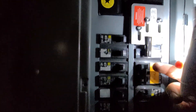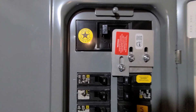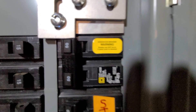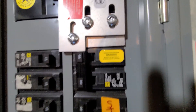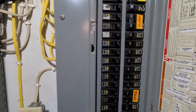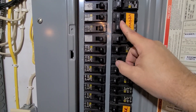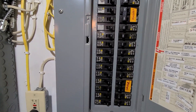So once I flip the interlock for the first floor apartment — I need to put down the light because I only have two hands — flip that, and now we're on generator power. This is the interlock, and this is our dedicated generator breaker. I'm gonna leave everything on, including the stove, because in past tests I did run the stove. The stove by itself does draw a lot, but it's still okay for the generator. I'm just gonna let this run all morning.